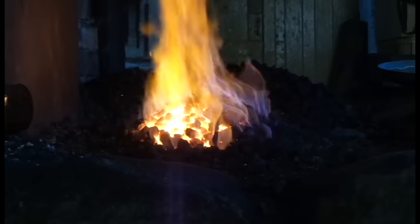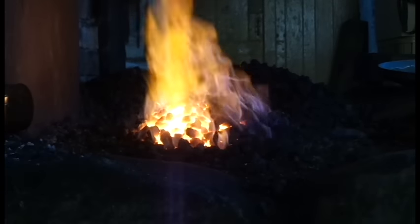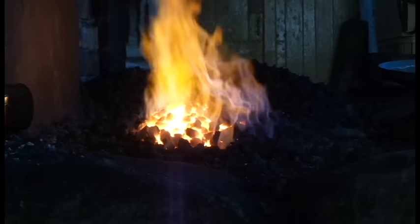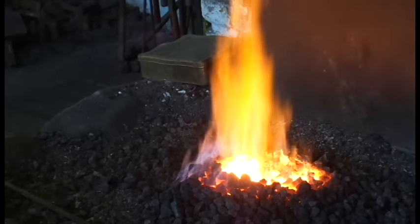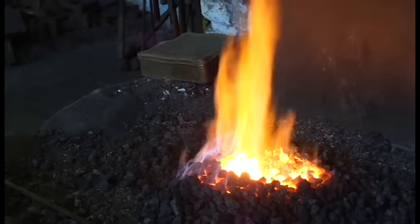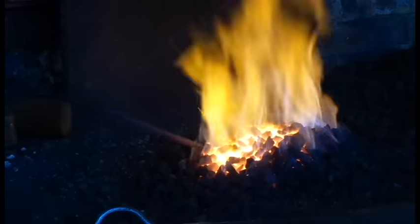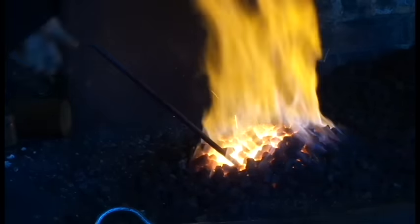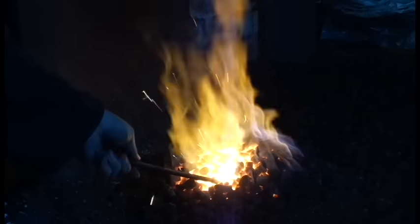The reason you need your fire to be a molehill is that it's composed of three internal layers: an oxidising layer at the bottom, a neutral layer in the centre, and a carburising layer at the top. If your fire is a crater or clogged up with clinker, then you only actually have the oxidising layer. The first layer is the oxidising layer because it's closest to the tuyere iron, and that area is rich in unburnt oxygen. This will cause your metal to burn at a lower temperature — don't stick your work straight into there, even if it is the hottest part of the fire.